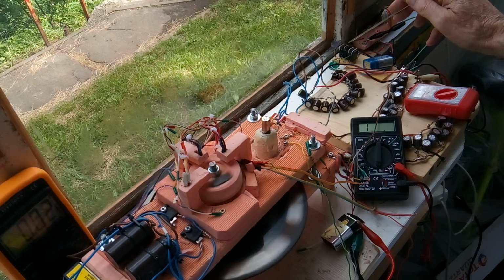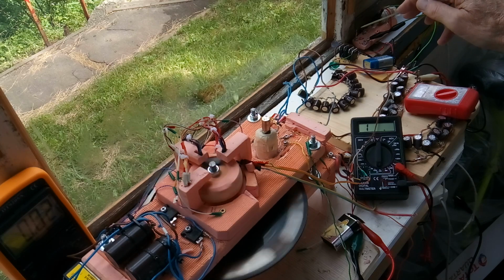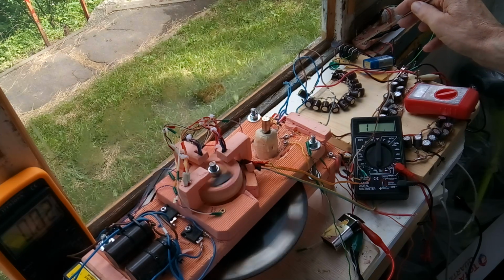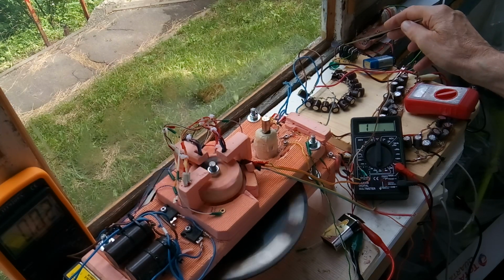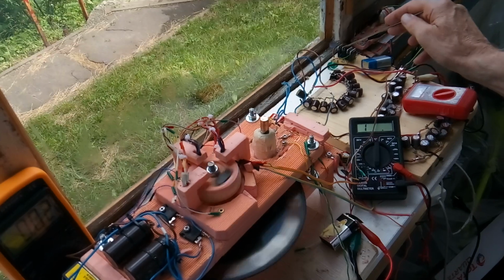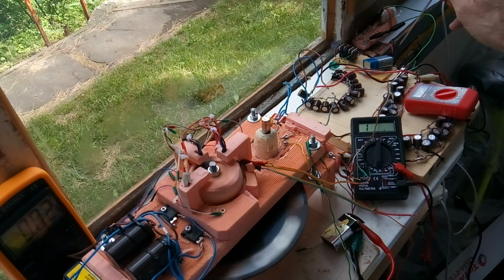Bidirectional gates and sources connect, and it's between drain A and drain B where the switching happens. And I paralleled two. These are 600 volt 46 amp MOSFETs. So I put parallel 2 and parallel 2 and then hooked them bidirectionally.